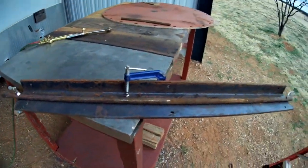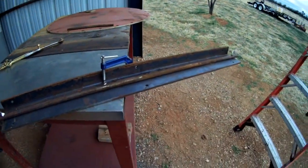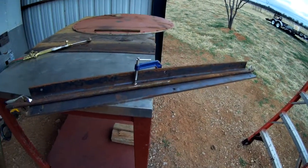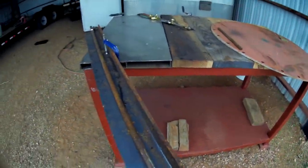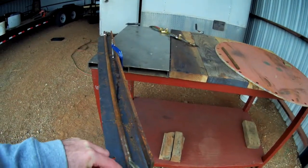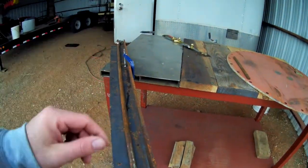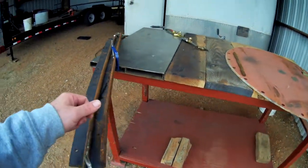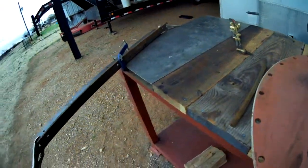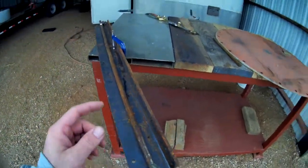Hello and welcome to Shenanigans. Today's project consists of making a straight edge from a few bits of scrap. I believe this was a hunk of what looks to be 3 inch by maybe 2 inch angle iron, quarter inch thickness. My plan is to hack off the bit with the factory straight edge, place it on the non-cut bit and weld it, then use some scrap sucker rod to make a handle.